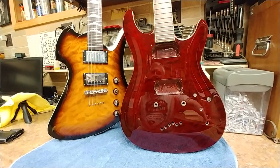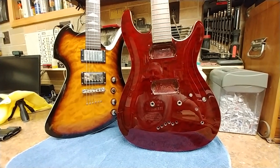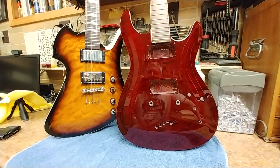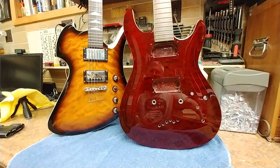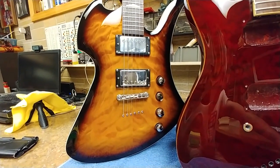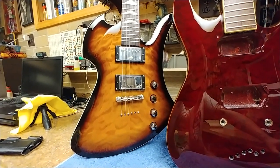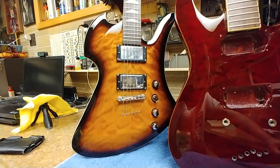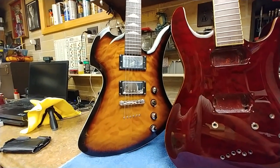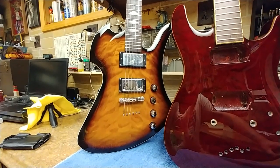So this is going to be a little bit of a comparison here. Now the bad thing is you're looking at a dark color compared to a lighter color — it's really not too fair because a darker color shows a lot more imperfections than a lighter color would, especially when polishing, sanding, and everything else. But when you look at the BC Rich, other than the glares, black is black. And when you hand rub something after sanding it, it's really hard to get the black to come out as black as possible. It'll look kind of hazy instead of having a nice clear reflection. It's a pain to try to hand rub something like that.